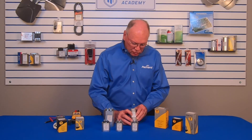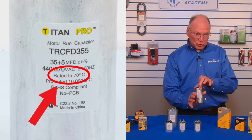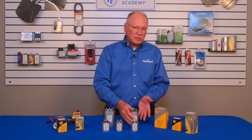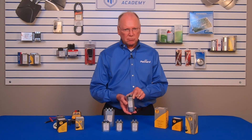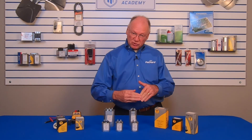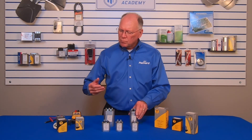This particular capacitor is rated to 70 degrees C. What does that mean? It means that the case temperature of this capacitor, when installed and operating, if it does not exceed 70 degrees Celsius — that's 158 degrees Fahrenheit — this capacitor will last 60,000 hours. If the temperature goes up or the case temperature exceeds 70 degrees, it'll shorten the life. If the case temperature is reduced, it extends the life. All of the Titan Pro capacitors are rated 60,000 hours.